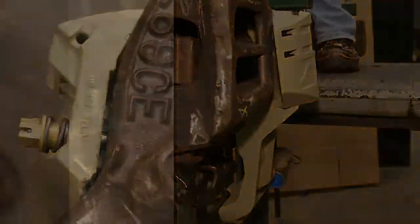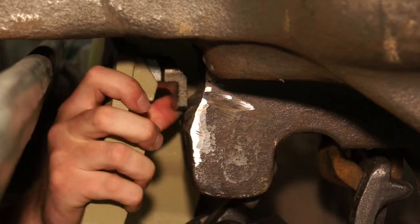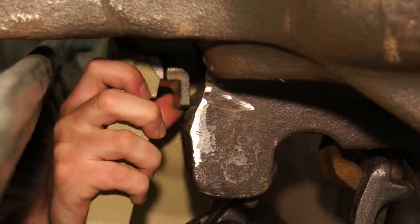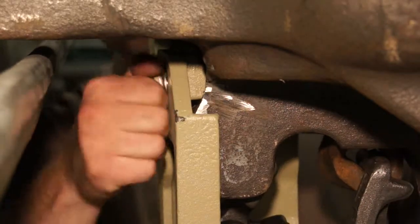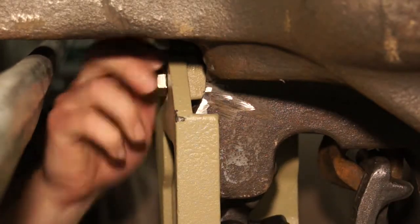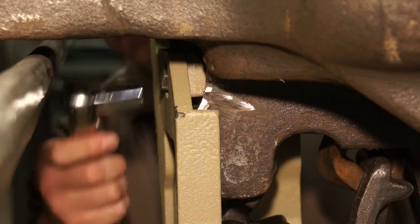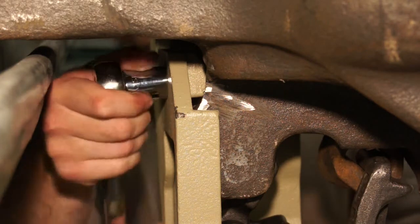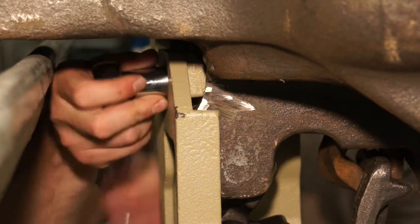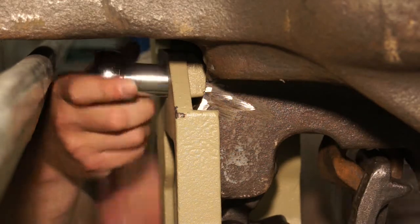Next, we need to set the axial mounting clamp. By lifting the bracket's horizontal arm, tilt the bracket back and slide it towards the pulling face of the coupler, so the axial mounting clamp will pass over the strengthening rib located above the lock lift assembly. You may need to wiggle the bolt a bit to get the clamp over the rib. Tighten the axial mounting clamp until the lock washer is engaged.